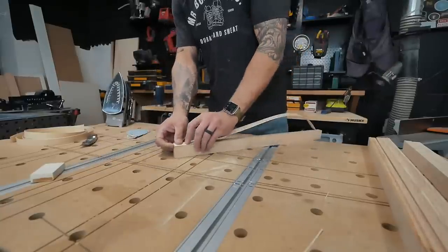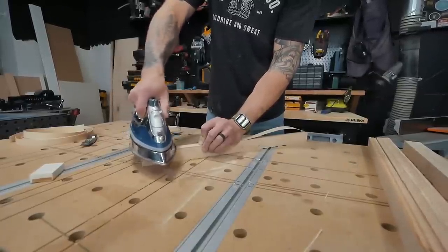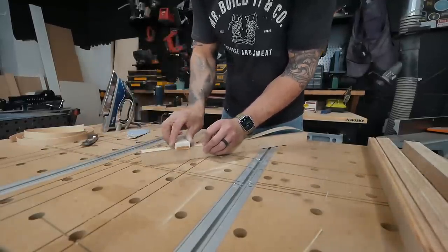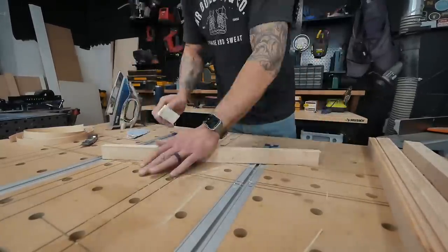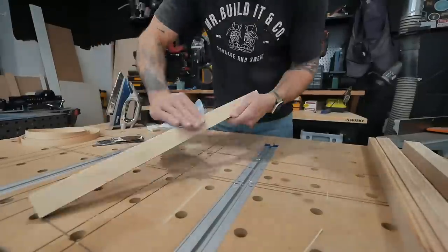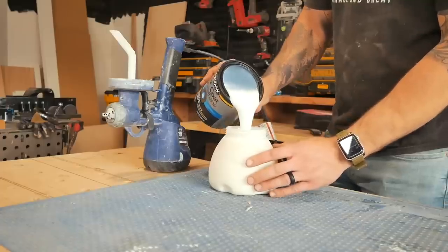To conceal the exposed plywood edge layers, we are going to edge band them. I bought maple iron-on edge banding to make a perfect match for the veneer plywood. Set your iron on hot and turn off the steam — spend about 5 seconds per section to melt the veneer glue evenly, then use a scrap piece of wood to press the veneer onto the plywood edges until the glue cools and dries. Trim off the excess veneer edges with a sharp blade and sand smooth using 120 grit sandpaper. I stained the shelves using Minwax Fruitwood and sealed them for protection using a polyurethane through an HVLP sprayer.